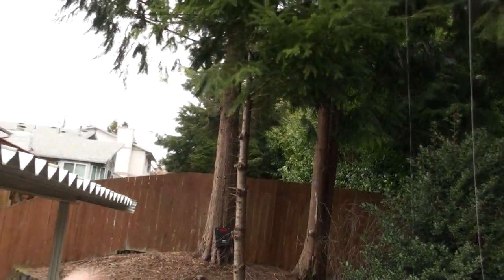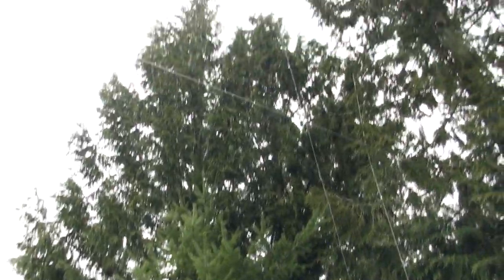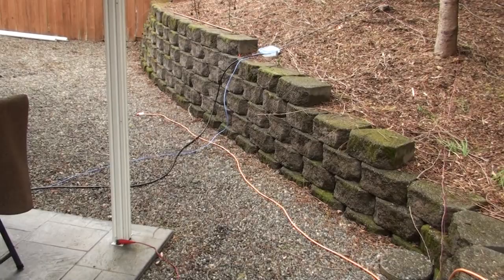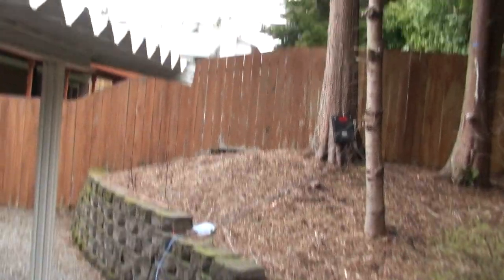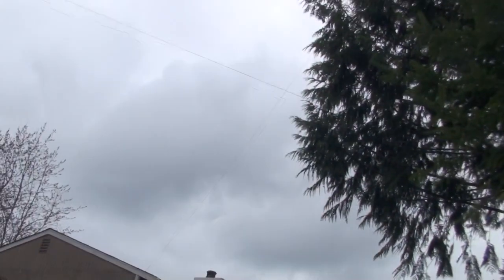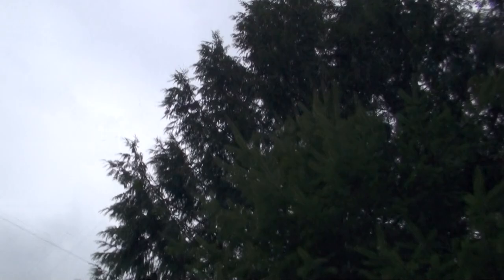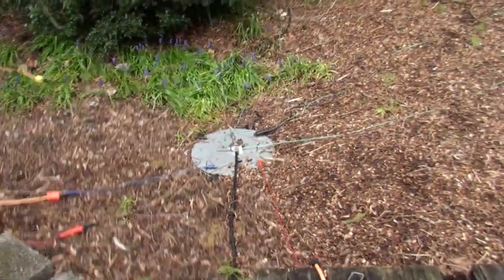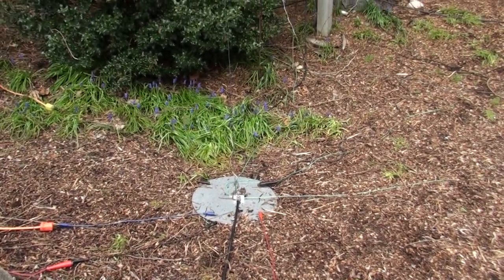So this will make a better 80 meter inverted L. Then I think I have a little extra distance with this back tree, and I'll do the same thing — basically move this 160 meter antenna over there. I'll put a stay line in front of that big tree, but the canopy is pretty big so it might drop down in front of the brick wall. Ideally I'd have it in front and right up in here someplace. I can build a little house for the feed point, but the problem is that's going to put it right up through the bulk of that canopy, unless I could zigzag it out, maybe pull it in a triangle. That sounds like a good summer or spring project.